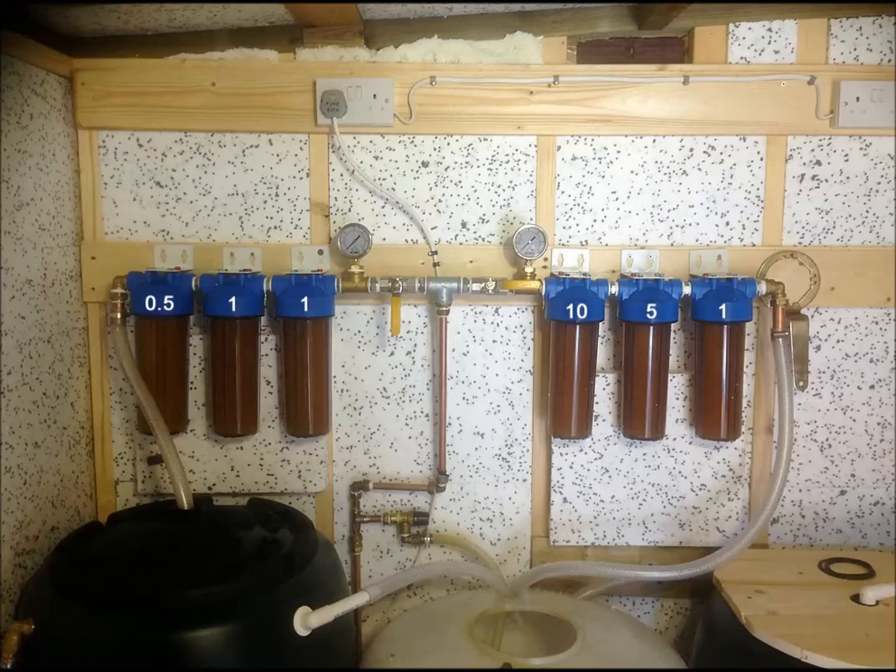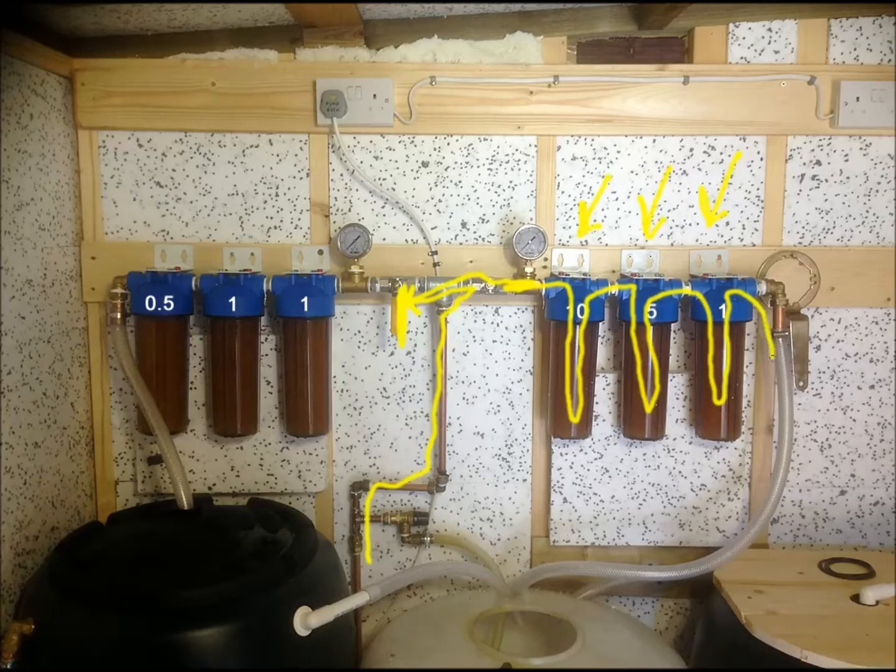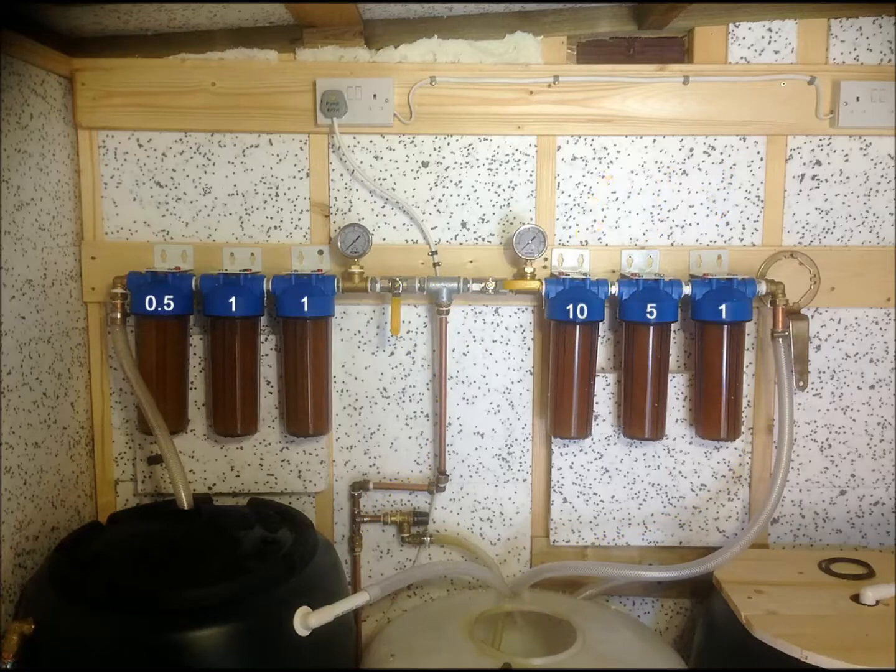What are these three filters? Let's have a close-up. These filters are a 10 micron, a 5 micron, and a 1 micron. So our oil is coming up here — it can't go that way because we've got a valve stopping it — so it goes this way because our valve is open. It passes through the 10 and gets clean, passes through the 5 and gets cleaner, passes through the 1 and gets even cleaner, then back down into the barrel. So we've now got oil that's at least 1 micron inside this barrel, and as we keep circulating the whole process over and over again, eventually we end up with nothing but 1-micron oil in that barrel.